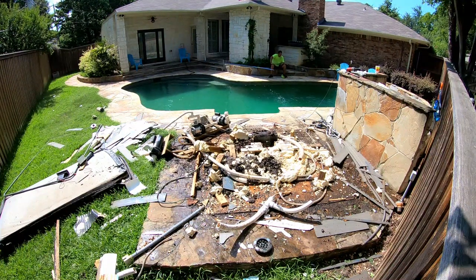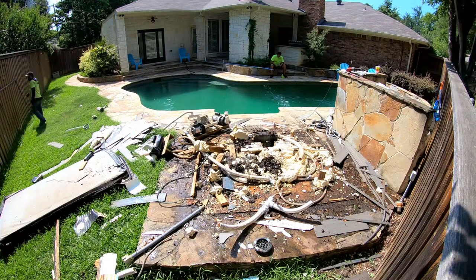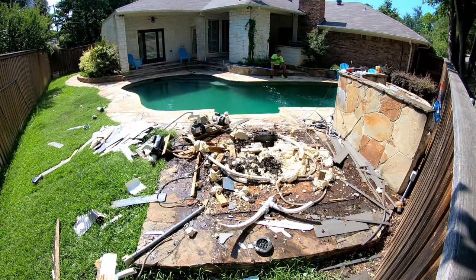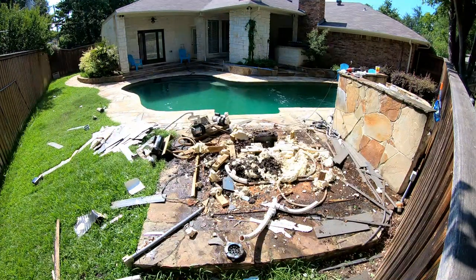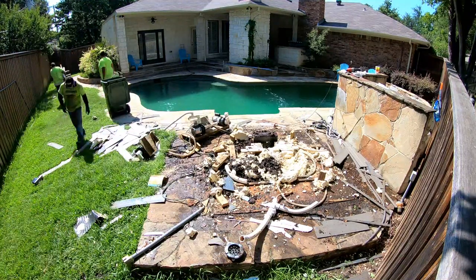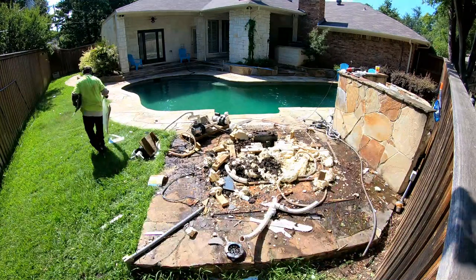We've managed to do it — it's simply a few steps. It's using the Sawzall the correct way and the correct blade to cut this hot tub. The day I cut this hot tub, I used a carbide blade which did all the work for us. I just gently put it on the hot tub and it cuts all the way through — that's why I cut it in such a fast motion. Four cuts, all of them up and down, side to side, and it cut it in four pieces.